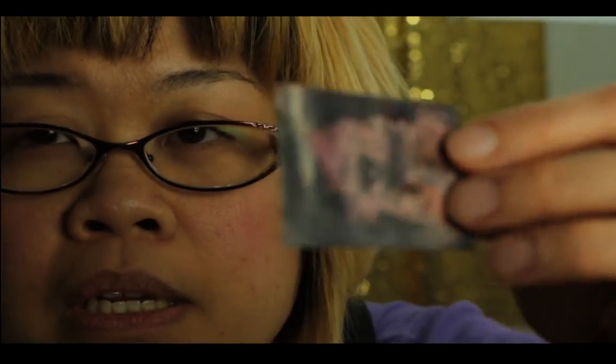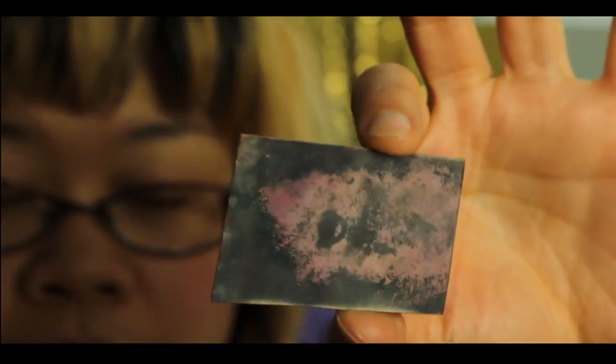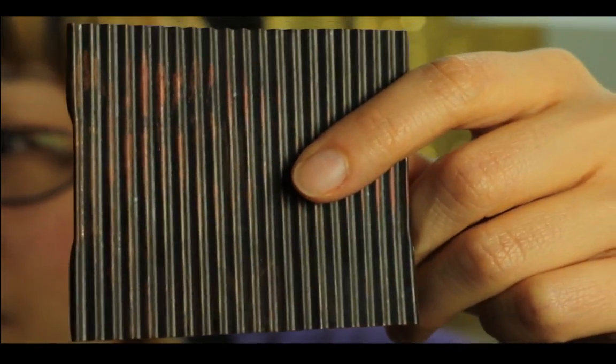Basically you need to anneal your copper, and this microfold brake can take 18 gauge pretty well, at least 20 and even more, because it can open high enough to fold thicker metal. But because thicker metal is less pliable, the texture would not be as deep as if you are folding thinner copper like this one, thinner sheet metal.